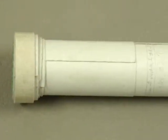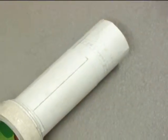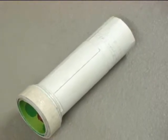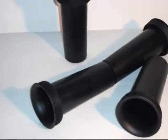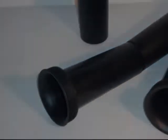And this here is a bass reflex port I just built for test purposes, which can be adjusted in length, so that I can measure the impedance curve and from that can tune it to the right frequency. This will of course be replaced by a plastic tube with rounded port ends afterwards.